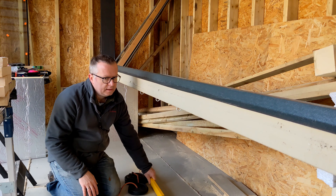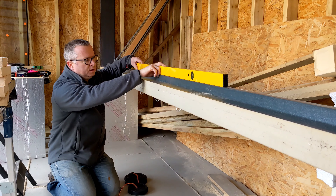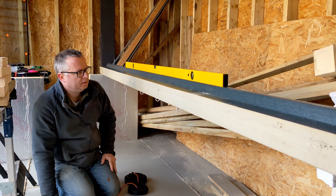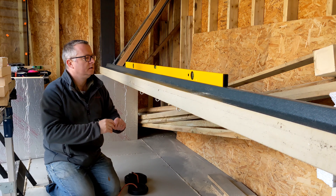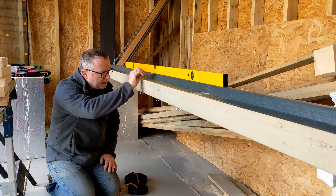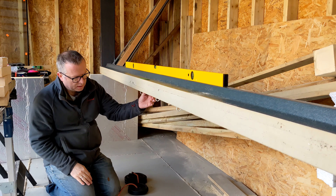I'm putting the level across the top. At the moment with no weight — just supporting the panel itself over the 3.4 metre span — there's a small tiny bit of deflection. I've got a 1mm packer here and it won't go in. I can see a gap but it's probably half a mil. So the panel can support itself and obviously the batten and the hooks.